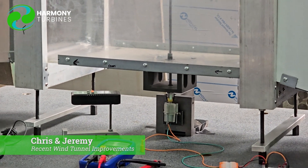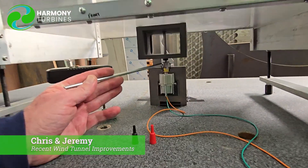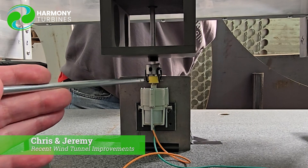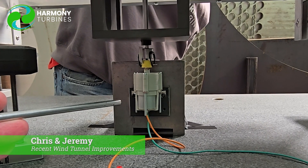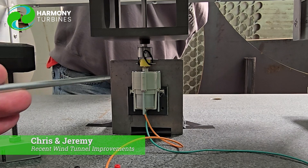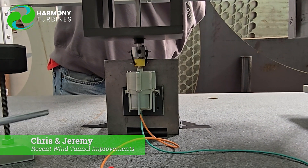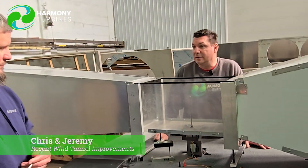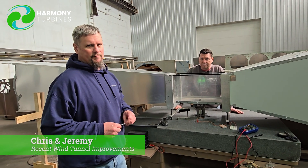Jeremy, you want to talk about our elegant solution? What we did — zoom in — we have a coupler on the motor and a coupler on the shaft, and then using a couple of pins we connect the two with o-rings. So now we have basically a joint that provides a lot of flexibility. We don't need to be lined up very well on an axial or even radial basis to take any of that misalignment out of the mix. Our concentricity can be off by quite a bit and we'd still function perfectly fine.